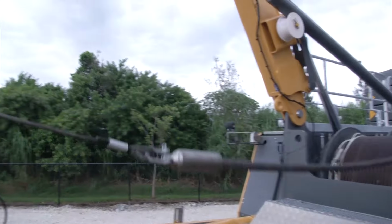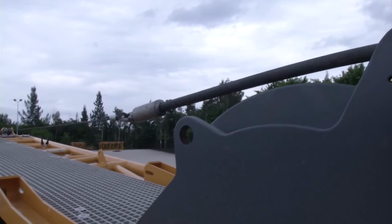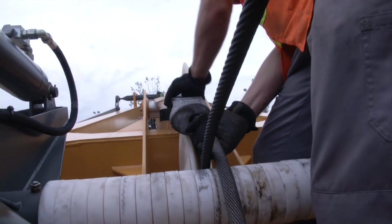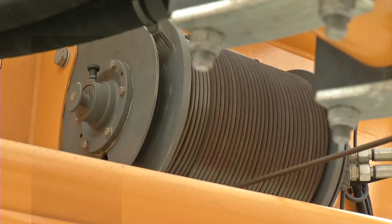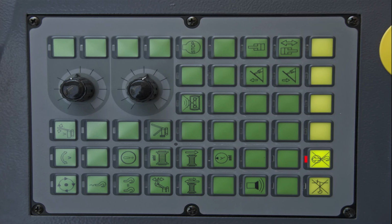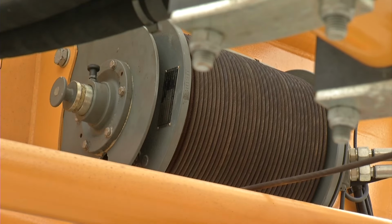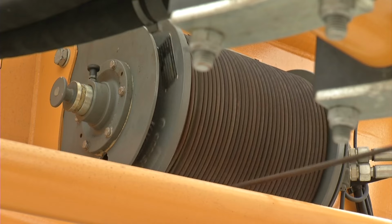With the help of the rope reeving winch, the hoist rope of drum 1 is led to the boom head and attached to the sling of the luffing A-frame 2 using the rope socket. The rope reeving winch hoisting function is controlled from the right control panel X11 in the cabin. The cylinder function must be pre-selected for this purpose. For unwinding the reeving rope, the freewheeling function can be activated via the winch clutch.